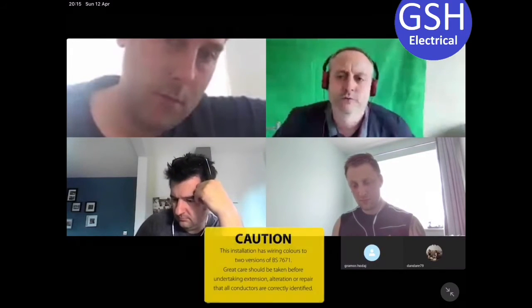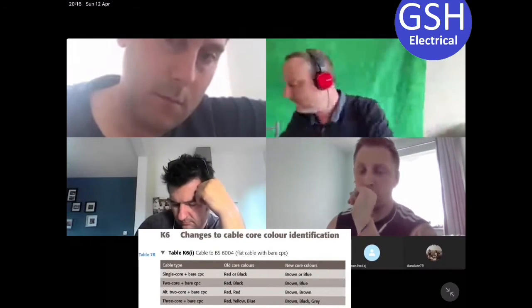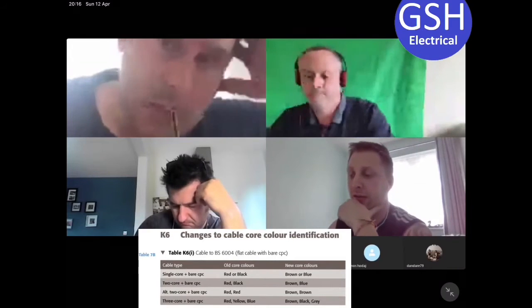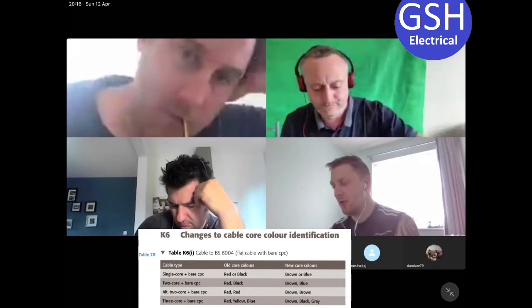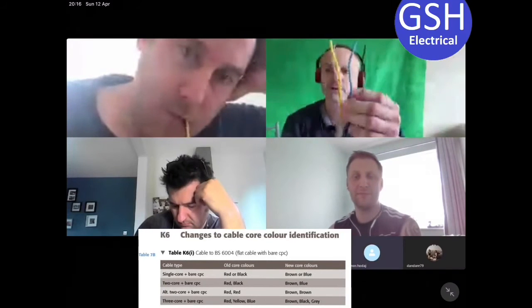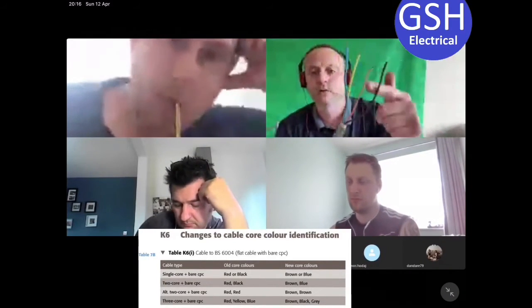And of course, we've got our three core colours in switches as well. It's when we step up to a three-phase system that's not enough. You can't, for instance, interface three-phase colours that are old. Anyone know the old three-phase colours? Yellow, blue and red. And if we added another conductor in there as well? Black. Yeah, so if we look here, old steel or armoured here, we've got red, yellow, blue, black.